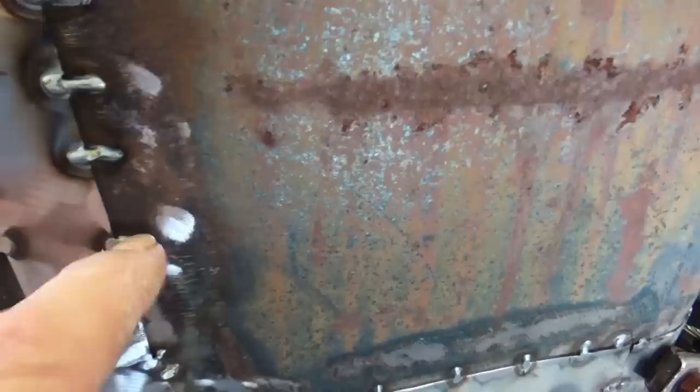Yeah, another thing too, I like to start my weld on the clean, in this case on the clean metal, and go to the rough, dirty metal. And you'll hear it when I'm welding, it'll start out clean and it'll hit that rusty and start popping, pop, pop, pop. So the cleaner you got that, the better off you're gonna be, but yeah.